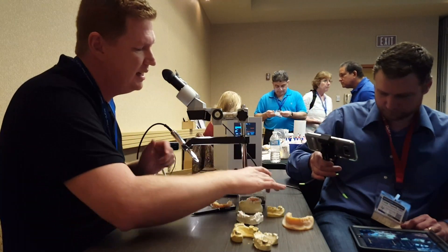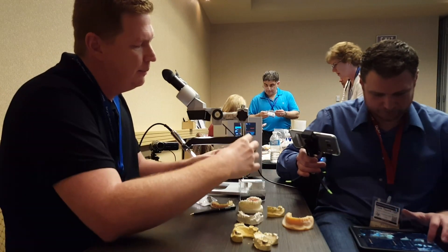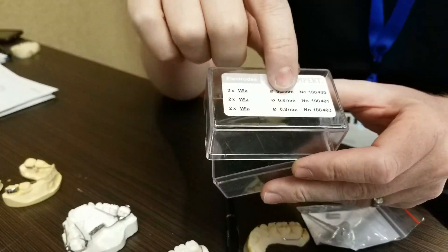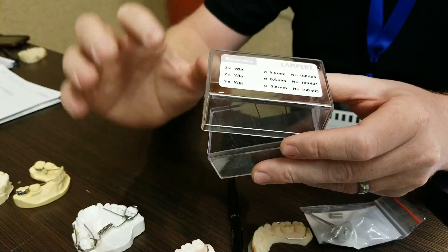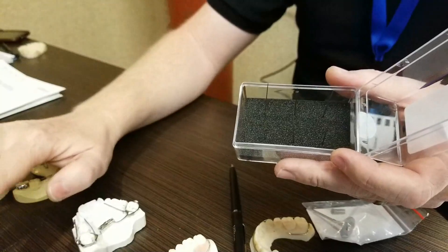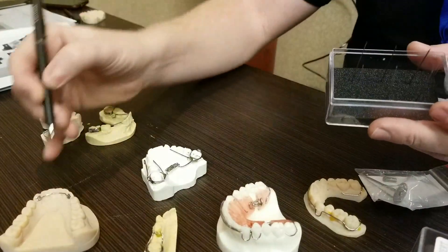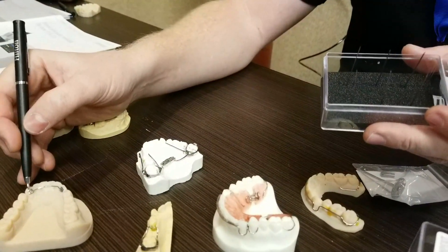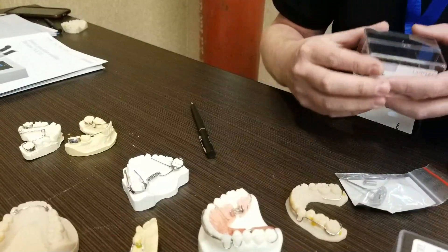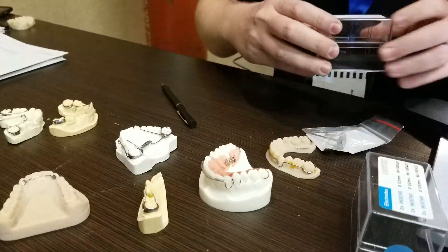I also changed the electrode. You get three electrodes. For the 0.6 we use that in about 95% of cases. The 0.5 is the thinner one — that's the one I used for that, just because the power is a little bit less. I don't want to overheat the wire or actually burn a hole in the mesh pad. Once you get to know the machine, you'll figure out what you like and how to work it best.